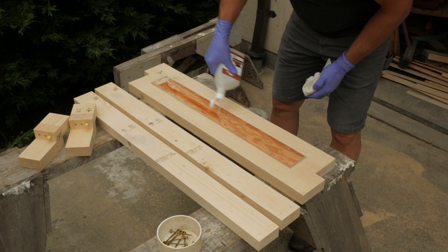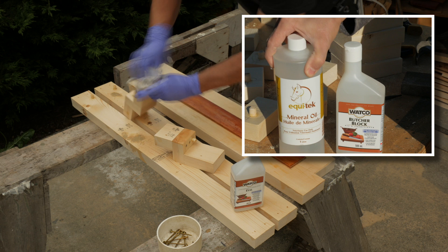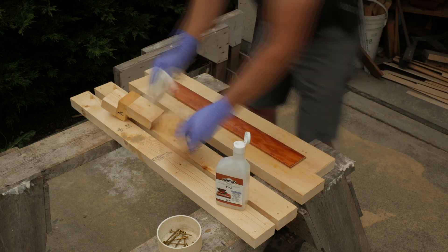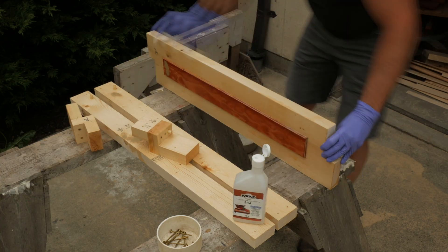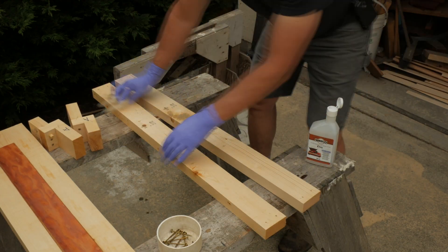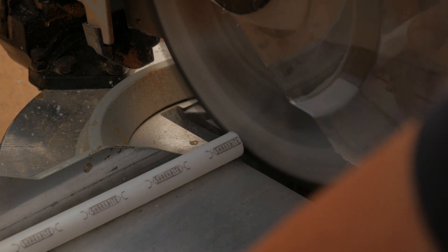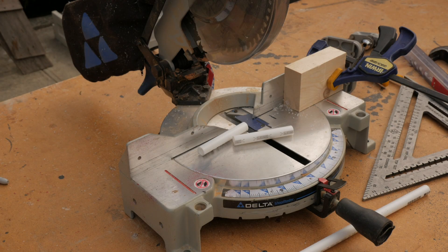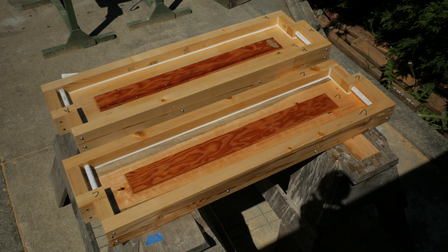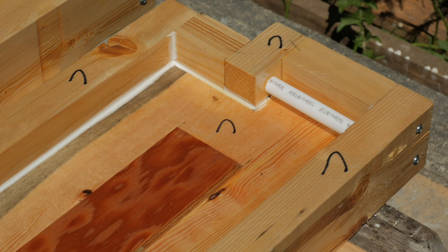I remove the screws and disassemble the form and apply two coats of food-grade mineral oil. This oil is sold as butcher's block or cutting board oil — you can also buy it in feed stores for about half the price. I liberally apply it with a cloth. It doesn't take long; each coat took about 10 minutes per form. While this is drying or soaking in, I'll cut the plastic pipe to length, and I cut a section of galvanized wire fence to reinforce the center section of the panel. This will be laid in the concrete once it's poured. I reassemble the forms with the pipes on the dowel pins, add some latex caulking to make the forms watertight and to add a small fillet in the corners. I cover the pipes with a cloth and spray the form with vegetable non-stick cooking spray.